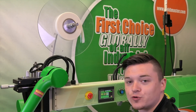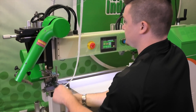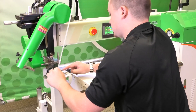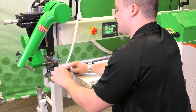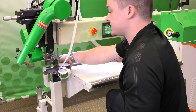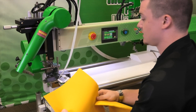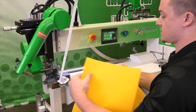We use the same technique for acrylic welding as well. I'm going to bring down the tape and throw it through the guide. The only difference with acrylic is that I'm going to put the tape underneath the weld wheel and then close it. Then I'm going to put some tension on the tape to get it nice and straight.